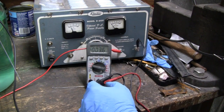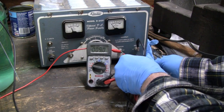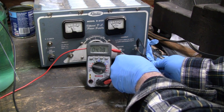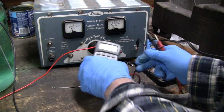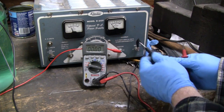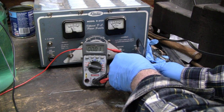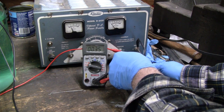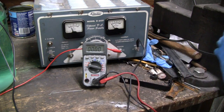You can't always trust these analog meters — that one says almost 5. I've got this set on DC volts — let's see what it says. Pretty good, the analog meter is pretty close. That's about 4.8, so let's call it 5 volts. Now let's turn it to amps and see how many amps we've got going in there. We got a half amp — 0.4, 0.5, 0.6 — let's call it a half an amp. You really don't need much amperage at all.